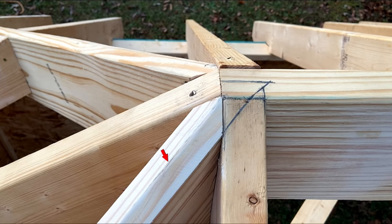Here's a close-up view to illustrate why the first jack deduction is different than the jack difference. The center of this hip is always going to run right up at the corner of the ridge. But the side of the hip, if we projected a line up, is not intersecting with the common. So since we're going from the square-ended common, it's going to be a different deduction to get to the first jack than if we were going to this point up here. Rooframers Bible gives you that first jack deduction from the actual common rafter length down to your first jack. On a standard hip it gives it to the long point; on a dual-pitch irregular hip it's always going to give you a short point. Then for all the rest of the jacks you'll use the jack difference.